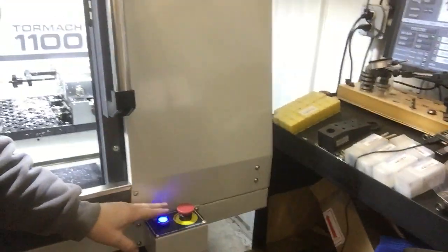If you're using the mouse to press the reset button, it's kind of funny — have your hand on that big red E-stop button when you're starting a proof of a program. It's kind of like going to a new country and speaking a foreign language until you actually get into it. You can study G-code, but until you see how the output is and what your machine likes, you're going to want to print out a copy of Tormach's G-code reference in big type and make a few posters for G-code, M-code, etc. — because all of a sudden you'll start to see things when you proof your program.